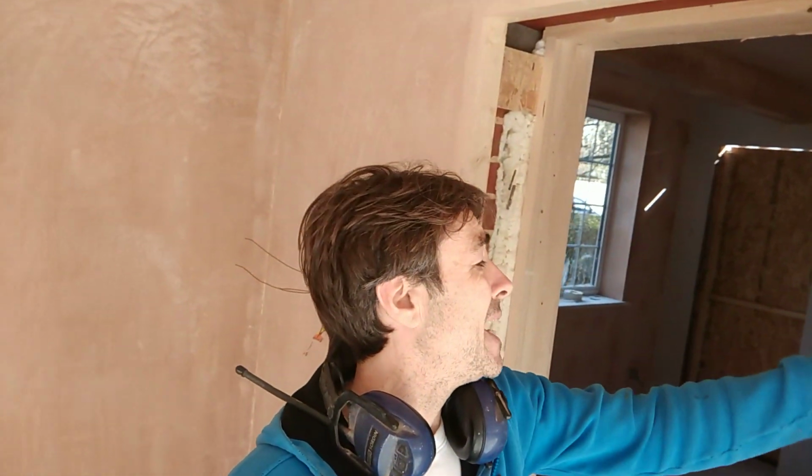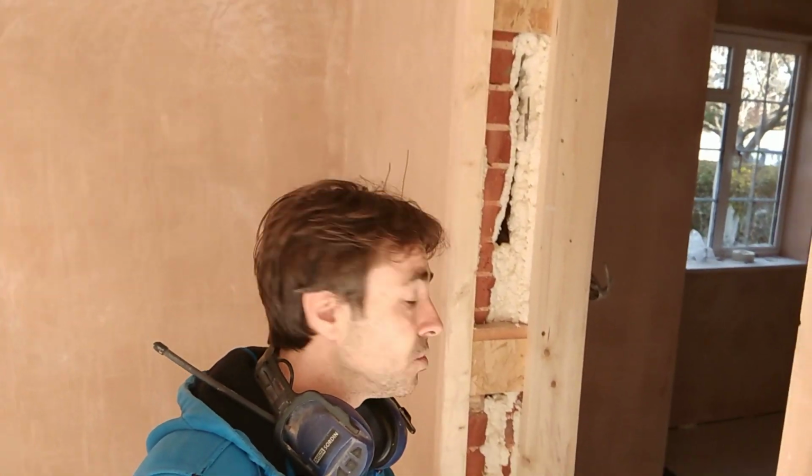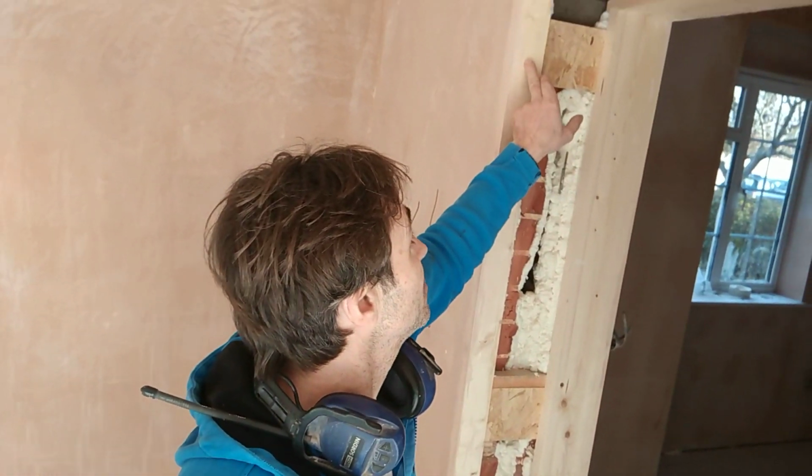But I make it all up as one, so when we make our structural opening we allow an extra 40mm. That enables me to back it up with sections of plywood, so we can make the whole lining parallel on the floor, square it all up like you'd do a normal lining, stand it in the opening, and what's really nice is you can actually fix through these pattresses that hold the lining together. So you've got less face fixing in the lining.